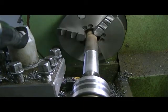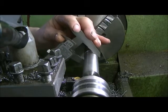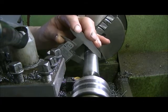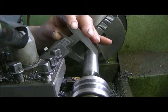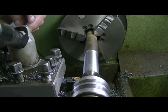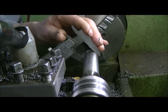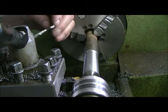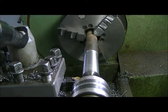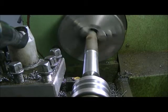We'll see what we have there now. It should be close. Sometimes it takes a little chewing. If you take very much off with a file, lots of times you don't notice it unless you measure all the way around, but things go egg-shaped on you really fast. Mm, 904.5. So we're half a thou out. I'm just going to take a little more with the file and I think we'll be right on the money. I'm going to use this other one a little finer here.